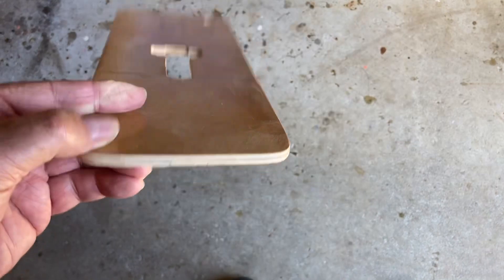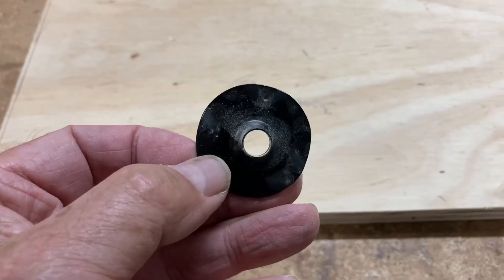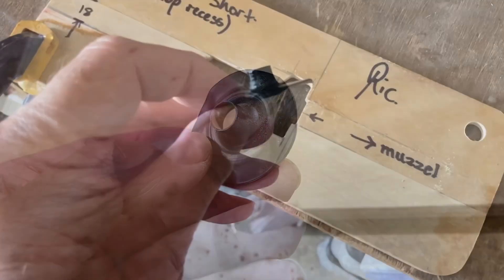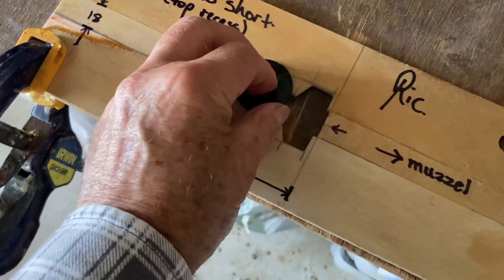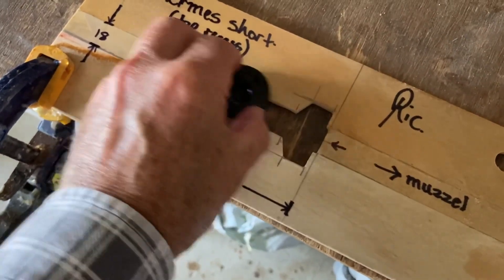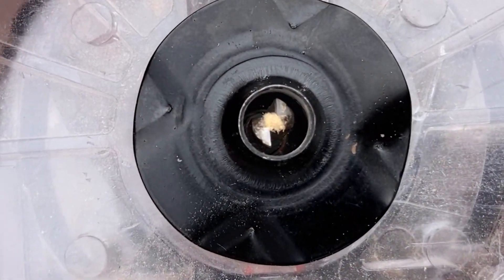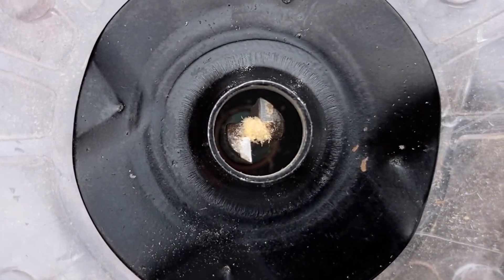The collar needs to be used in conjunction with a stencil or guide. I made mine by gluing up some plywood. The collar stops the blade of the trimmer router from cutting into the guide and follows the edges of the stencil. The problem is that the collar is larger than the actual diameter of the cutting blade, so you have to make the hole in the stencil just a little bit wider to account for this extra difference in distance.